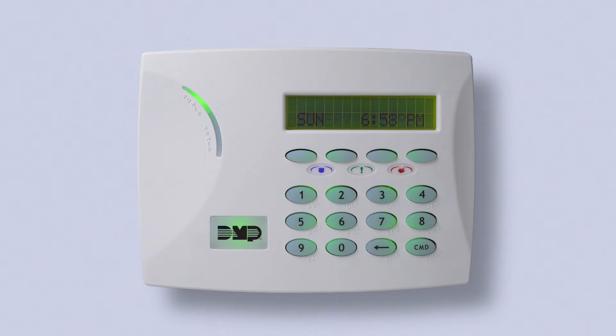To arm all on an area system, press the Command button until Arm and Disarm is displayed on the keypad. Press the Select key under Arm, then choose Yes for All. The countdown will begin and your system will be armed.